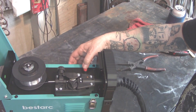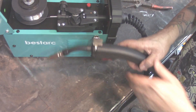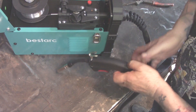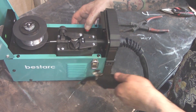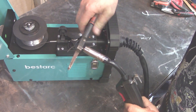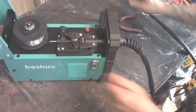Set the tension right on the roller. If you don't have enough tension, you won't be able to bend the wire — see how I bent the wire there? Put it against something solid and press on it, and if you don't bend the wire, you don't have enough tension on the roller. You want to get the tension as light as you can while still being able to bend the wire.